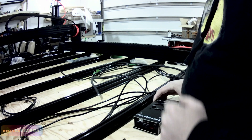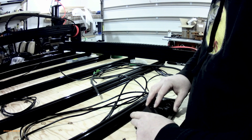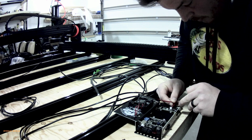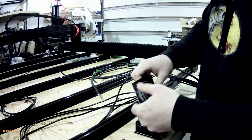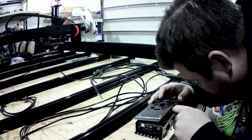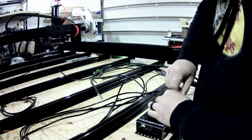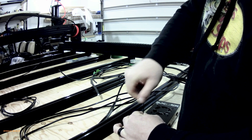Because we're hooking up proximity limit switches, you're going to want to take these four bolts out — in the four corners here — and pop this off. There'll be a little jumper here that's on 5V. You want to switch that to 24V because it needs more voltage with the proximity switches than a normal mechanical limit switch. I believe this is a 2.5mm Allen key.